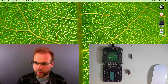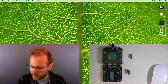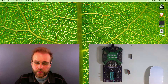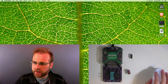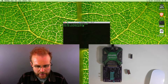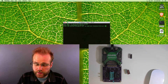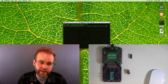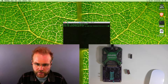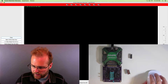We've tested the Analog Discovery, verified the waveform generators work, and calibrated the device. Now plug your Memristor Discovery board into the Analog Discovery, and boot up the Memristor Discovery software. We previously downloaded the JAR file to a directory. Open a terminal, navigate to that directory, and launch it by typing: java -jar, then specify the JAR filename. Since this is the v1 board, pass the v1 flag. To test that the board and equipment are functional, also specify the test flag. The full command is: java -jar memristor-discovery [jarname] --v1 --test.